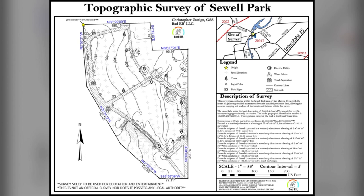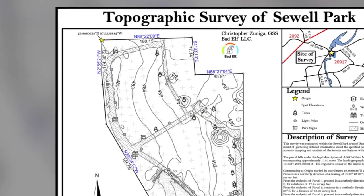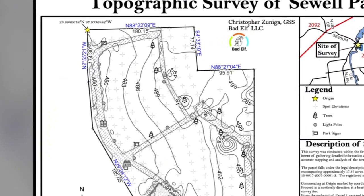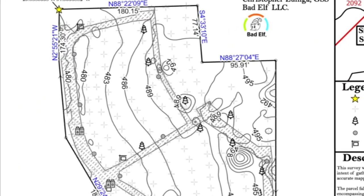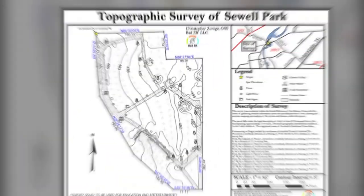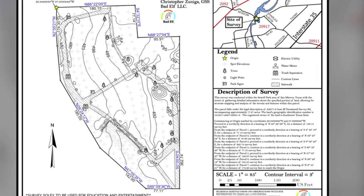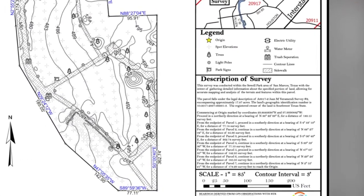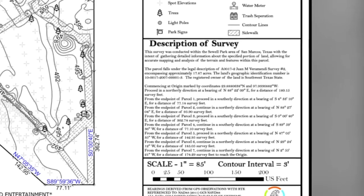Because we are working in Pro, overlays were unavoidable during the mapping process, but their visual effects have been minimized so that our elevation data is shown discreetly by contour lines. The coordinate geometry, or COGO for short, refers to the distance and direction between two points. Here, these values are shown as the blue and black labels on each of our boundaries. These values were created by calculating the geometry between our coordinates to produce a distance and bearing from one to another. This description consists of written directions that use the coordinate geometry to describe our survey boundary, enabling anyone to follow our boundary in the future by starting at the origin and following the bearing to the specified distance.